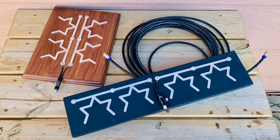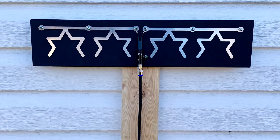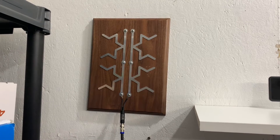I made two antennas: one with the elements oriented in a vertical fashion as suggested in the instructions, and another with the elements oriented in a horizontal fashion, which I believe will be more suitable for my area since all of the channels broadcast on VHF. I tested these antennas both indoors and outdoors, using a spot on the wall I normally use for indoor antenna testing.